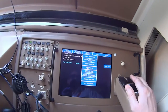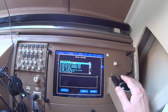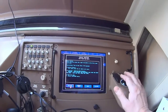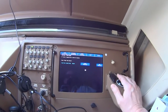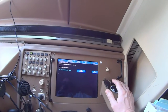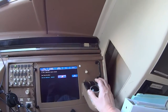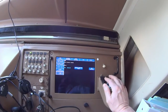Now what I'm going to do is go to the other functions, down to the special functions section — cabin temperature control. Let's see, open the right Ram door. Continue. It comes up with the conditions of the test — really no conditions for this to run it, so I'm going to open it now. Everything's met — all the conditions are met. Start the function. Now it's operating the motor to drive the door open. It's completed. Now that door on the right side of the airplane, that Ram Inlet door is open. We'll exit the maintenance functions.